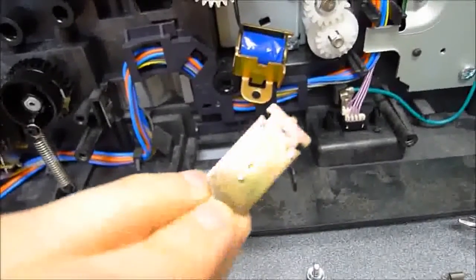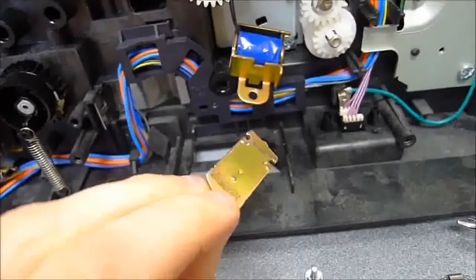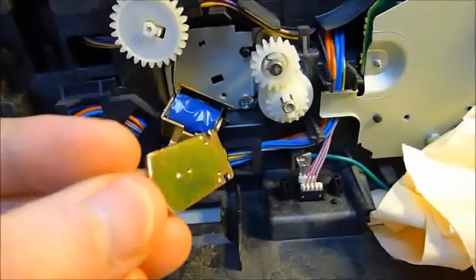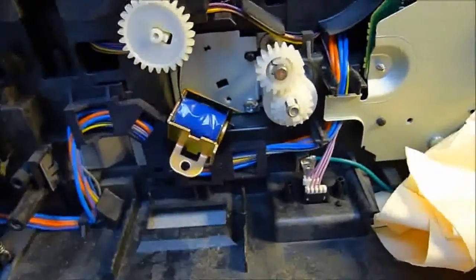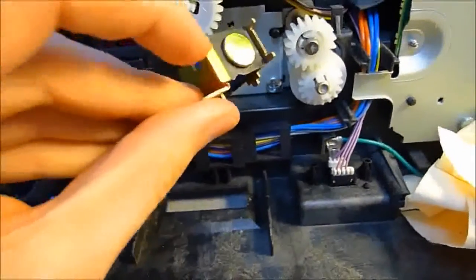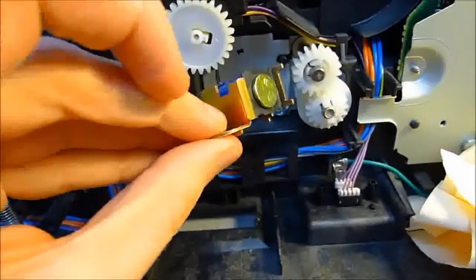So we go find some rubbing alcohol and a tissue and go to work on it. As you can see, we've removed all of the adhesive from the armature of the solenoid, and we've also taken it off the body of the solenoid. We can see how clean that is right there — and more of that black adhesive is visible.